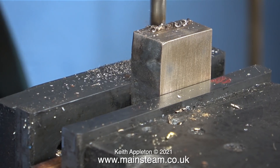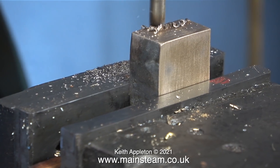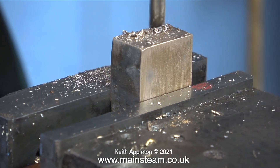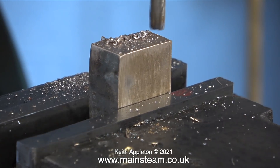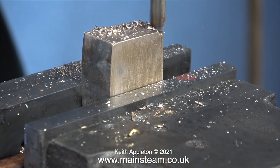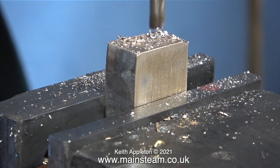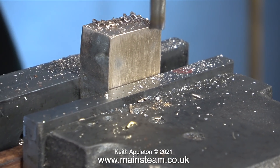I'm starting this video by showing how not to do the job. For instance, the cutter that I'm using is too small and very blunt, and I'm taking the cuts the wrong way. In this clip the cutter is still blunt, but now instead of taking longitudinal cuts I'm taking transverse cuts. By doing this, even with the blunt cutter, there is much less chance of the block moving out of the way.